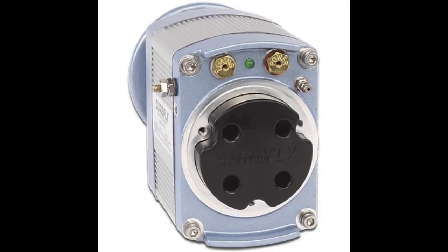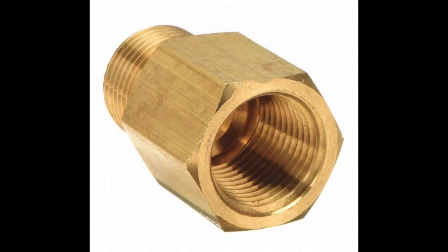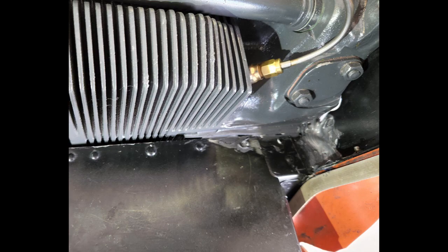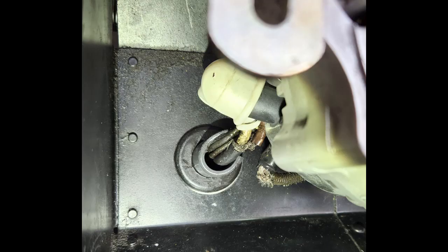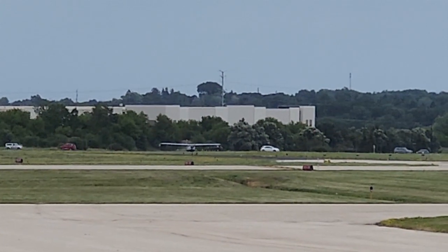The final solution was a pair of fittings to snake through the open space, both made of steel for strength. I also pulled a new wire from the tail for the SureFly mag, modified the governor bracket for the non-D engine, added a snubber to the manifold pressure line, and installed the new Hartzell Trailblazer prop. Then there were the normal things like sealing around the top engine baffle, sealing the head portion of the baffle in front of the number two cylinder, and trying to fill up the through-holes. Of course there's always one more thing — in my case it was the throttle cam. Luckily I had one on hand.